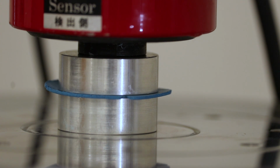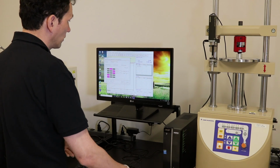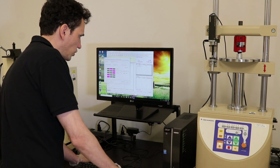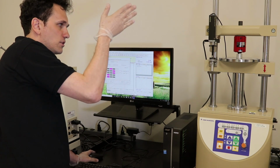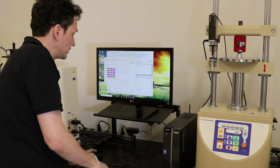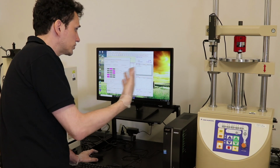The other piece of detail that customers want to know is how the material is going to relax over time. So we know from our own experience of these putty materials, and it's most of the GR materials in general, after about a minute, you see from that T0, when you stop, down to about 1 minute, you see a sharp drop in the stress, and then it starts to kind of bottom out. So we also look at that as well.